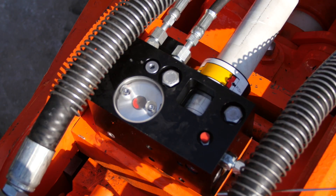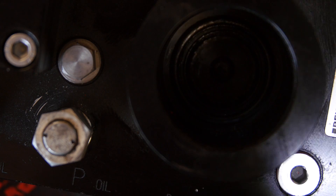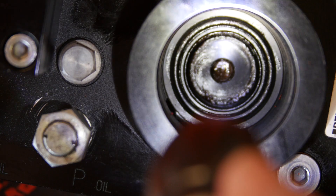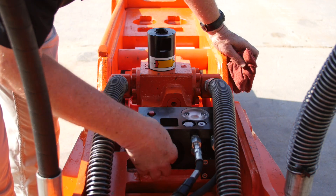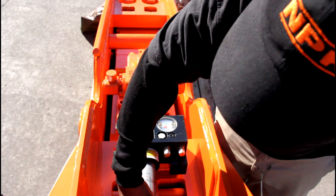To maintain efficient hammer lubrication, conduct routine inspections on the Autolube system. After removing the empty grease cartridge, make sure the flat seal is present and not damaged. If the flat seal is missing or damaged, it must be replaced. Next, inspect the lubricant passage for contamination, then apply a light coat of grease to the O-ring located in the pump housing and install the new cartridge.